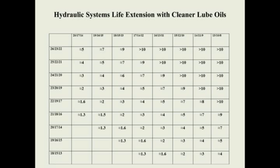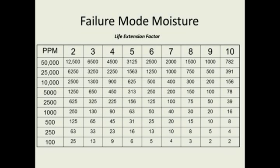And you know, I've proven this to the plastics plants, and there's a number of cargo plants that are having these successful results by filtering their lubes down to these low areas, down to the 5 and 10 micron range. They're getting up to 7 to 9 times the life out of their hydraulic systems, their pumps and hydraulic motors and hydraulic components, just by keeping the particles out.